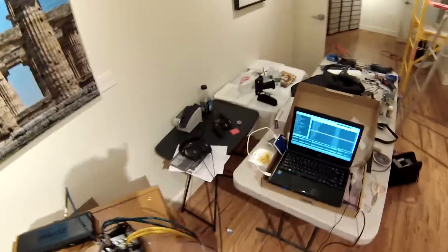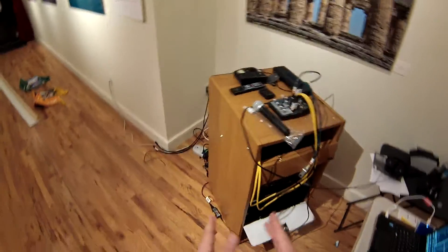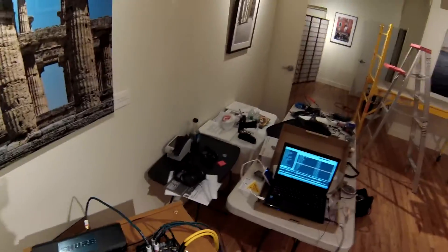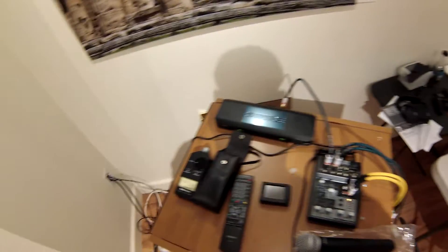The output of the mixer is split between the two analog audio inputs on the receiver. That allows me to run HDMI video and tell the receiver to take its audio from the two analog sources, using a splitter. So the microphone can be used while you're playing video from a laptop or Blu-ray — you can still talk over it. He's never going to need both sources at the same time, so that should work out fine.